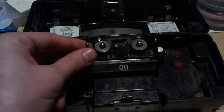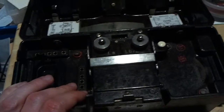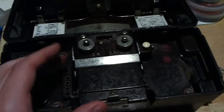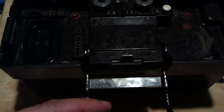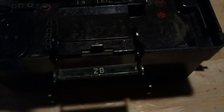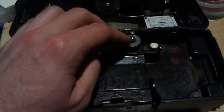This is of course your on-hook, off-hook switch. When it's in this position, it is on-hook. When it's like this, it's off-hook. When it's depressed, it's on-hook. You use two different pairs of switches to do this. You've got your connection terminals here.